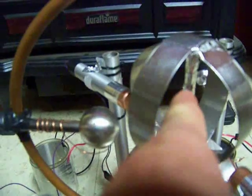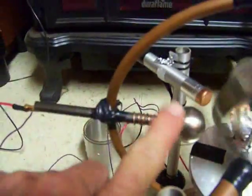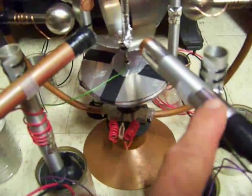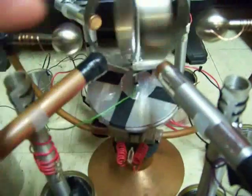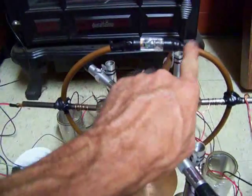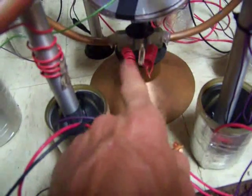It's on a steel shaft that goes up. The rotor is stainless steel and it has inside there a little piece of carbon rod and a BB for a bearing. Then I have one steel rod with a steel ball on there, one copper rod with a steel ball, and then one aluminum rod with a copper cap at the end of it. There's two sets of each of those. And then this ring has a neon bulb inside there which is a tightly wound coil of wire coming all the way down through there and then coming out right down here. The same thing goes through a neon bulb and then another coil wire all the way up through back to the other side.